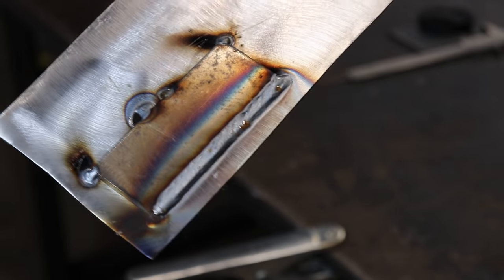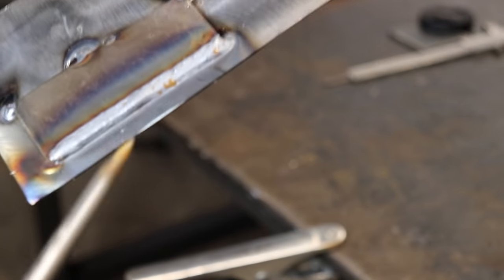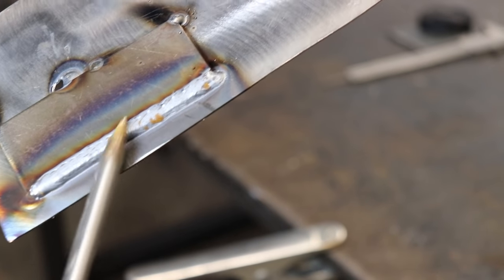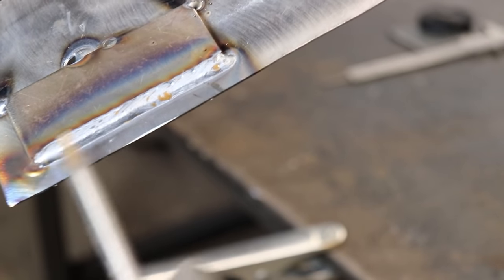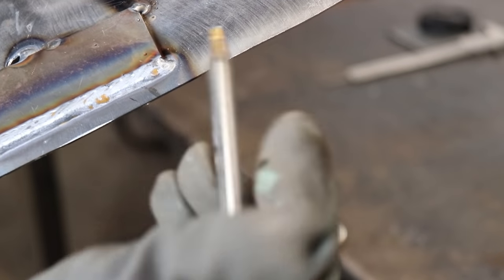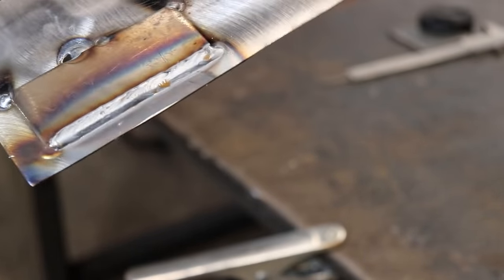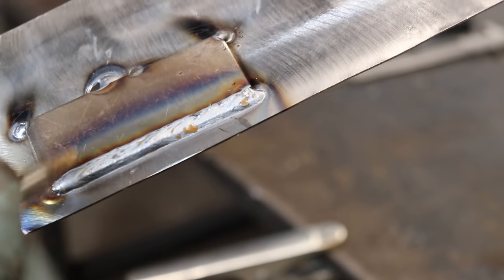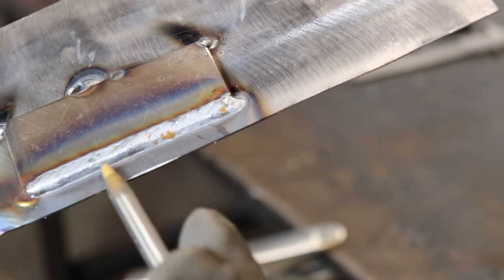So you can see the difference — I managed to get all the way across there without blowing any holes through it. And if you look close you can see where it's really taken all the top edge off where I've been pulling it back up to that top edge. It's a really tiny amount of difference that you're actually making — that drawing I did over-exaggerated it massively. You're literally just dragging it back up onto the top edge each time you move forward, just pulling it up a little bit as you move forward.